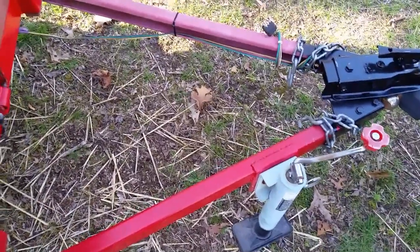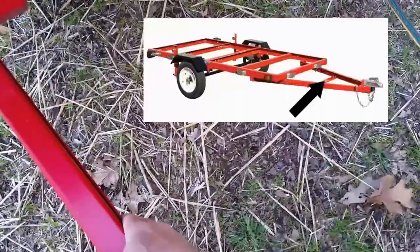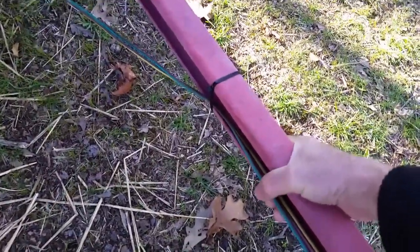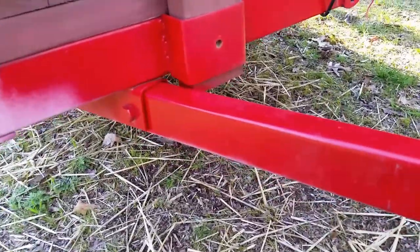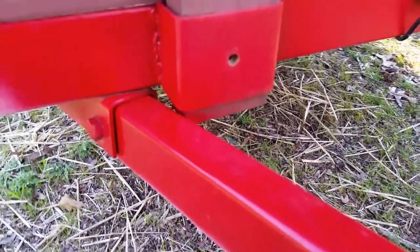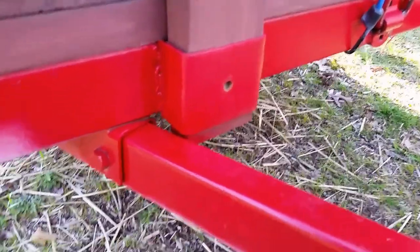In the new models they're selling now, the trailer is foldable, and they've added a crossbar bolted on across the frame. I noticed the frame does flex a little when there's no load on it, so I might weld an angle iron across it. Mine is designed to dump by pulling pins, but I decided that wasn't a good idea for me and put permanent bolts in there instead — that probably contributes to being a little more stable than just having a linchpin.